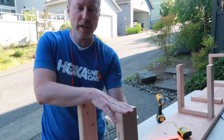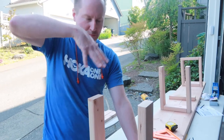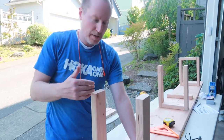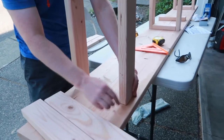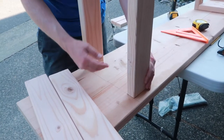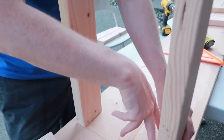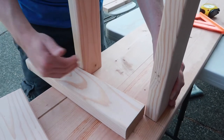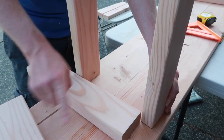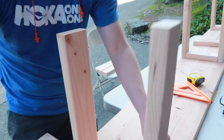So building the legs is a little tricky — you've got to get your height right, and it has to be kind of customized because it all gets out of whack. What you do is first figure out where you want to set it in there. We came in an inch, and we're going to use the Kreg jig so that we can screw it in. Once we get both sides screwed in, we will then measure and cut the middle piece, Kreg jig it, and then do the upper piece.